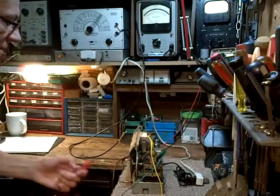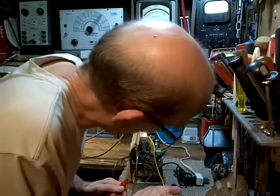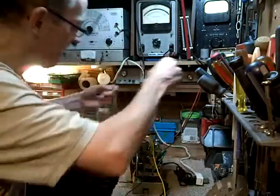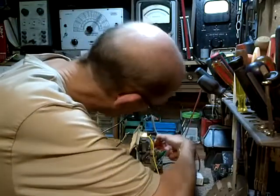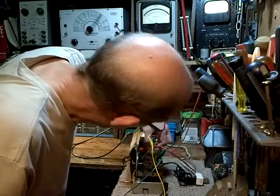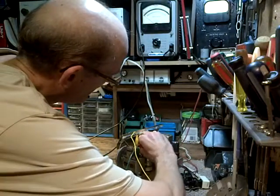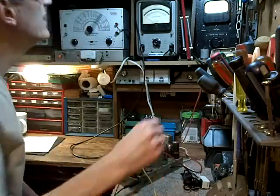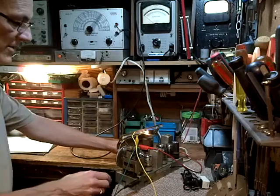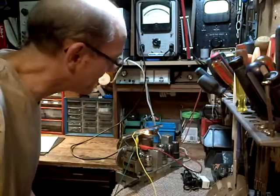Oh yeah, we're going to connect up our meter here. And I was told by one of my viewers, thank you very much, this lead going nowhere from the speaker is intended for doing these kinds of tests. So I'm going to clip up my voltmeter onto this, what was a mysterious wire for me before. Okay. And the meter is responding now. I could by rights be connecting this onto the grid of the converter tube or something like that.